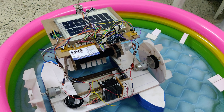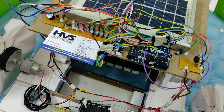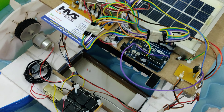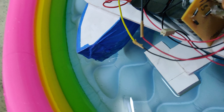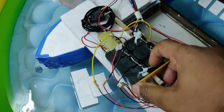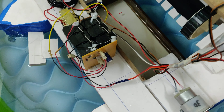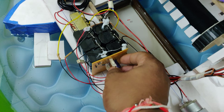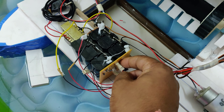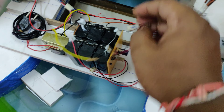To charge the battery from the transformer, connect it at the T slot — T for transformer. Provide 230-volt AC input power supply and the battery will start charging. It takes around eight hours to be fully charged. When fully charged, the charging circuit will automatically block current flow to protect the battery from overcharging.